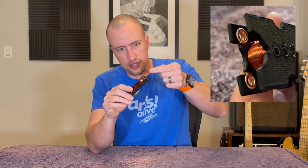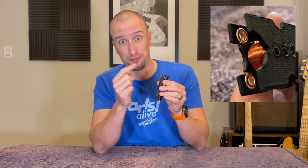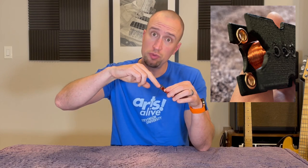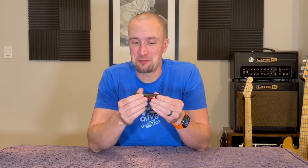At the end, once I had my 7,000 winds, I cut the wire from the spool and used tweezers to feed and loop the end through the other grommet. So we tied off the first end to one grommet, did the whole wind, and tied off the other end to the second grommet. This will allow us to solder in our two wires when we're ready to put this into the housing and install it. The next phase is to wax pot these pickups — click the link at the top for the next episode. After that, we'll be playing these in the bass. Thank you so much, and until next time, play on!